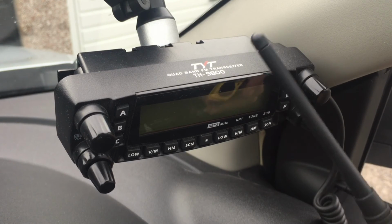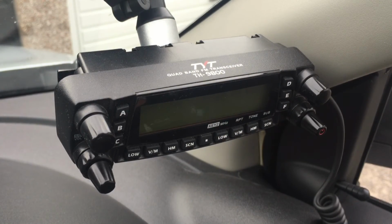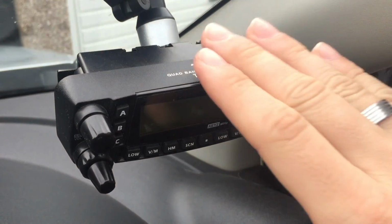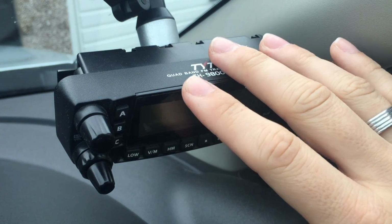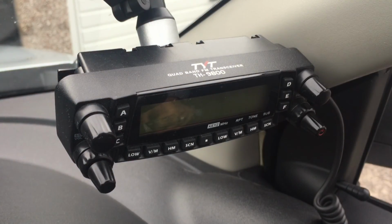But yeah, this radio is definitely handy to have in the car, instead of something like this, for keeping tabs on marine, PMR, all that sort of stuff, airband, etc. It would be nice if I could use that as a main radio, and you've probably wondered why I haven't. On transmit and receive on the amateur bands, I haven't found it great. I do a lot of portable work, and the front end on this radio is really easily overloaded, and it's quite sensitive compared to the ICOM. So for example, if I went up my local hill and there's a transmitter tower within half a mile away, it absolutely swamps the front end on this radio and makes it deaf. Whereas that doesn't happen on the ICOM. It's not prone to interference.